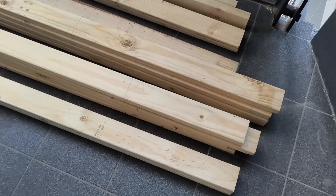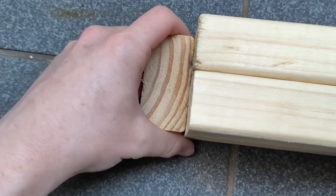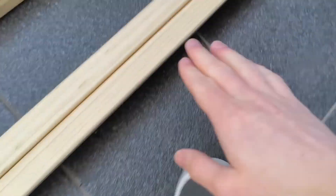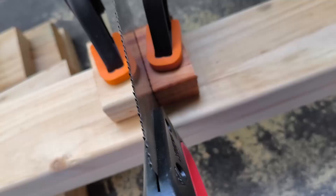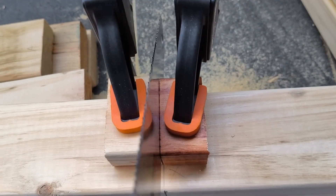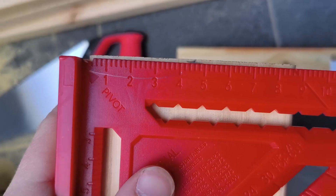Based on the cutting list I have all the timber here organised. I'm clamping 2 pieces of wood with the kerf of the blade on the line I need to cut; this will hopefully keep my blade from straying. I end up cutting the rest of the timber on my balcony. The cuts look pretty good and are at least consistent.